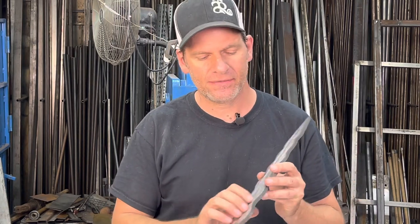The Kris Dagger is now roughed out with the plasma torch. I ground it a little bit, then took my 3D printed template and put it over top, then spray painted. I like to use high-temp spray paint because as I'm grinding the profile it gets hot — normal spray paint or ink will burn off, but high-temp spray paint holds the line so you can continually grind off all that excess material. Thanks again for watching Bonifab Custom. We're going to continue this next week — don't forget to subscribe and push that button for notifications for the next videos for our Kris Dagger. Thanks.